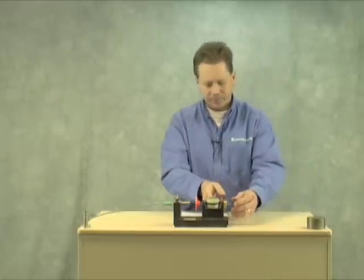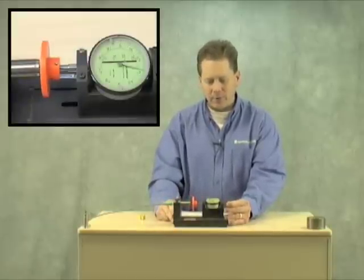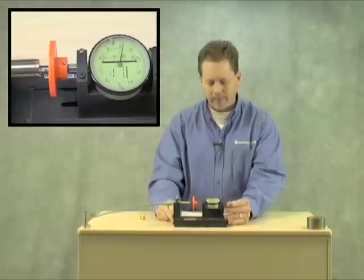I'm going to show you first the PNF NMB10 Piledriver, which has 10mm range and an 18mm diameter barrel. Using this test fixture, zeroed out, I pull the target back and go forward — turn-on point is 9.5mm. Going back, also 9.5mm. You can see the hysteresis: it stays on for a short bit within 10 or 15%, and then it turns off.